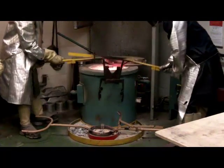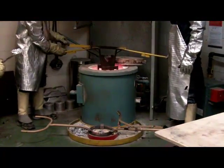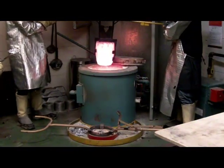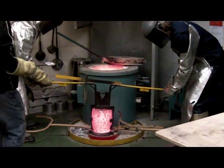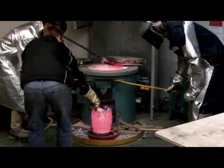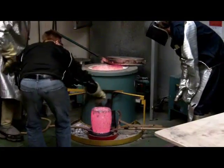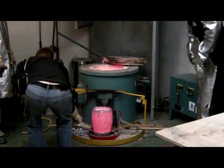Here's the vat with the molten aluminum. They're reaching in to grab the flask of molten aluminum and will set it down on the tongs in front of it. You can see that it's glowing red hot. They'll scrape the slag off the top of it. What we have is molten aluminum inside the pot, and then they'll grab it with the second set of tongs and bring it over to do a pour.